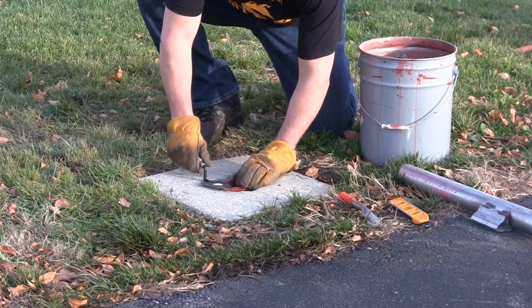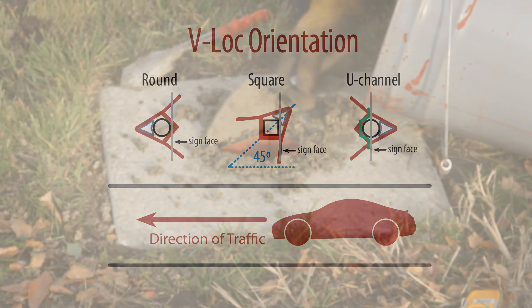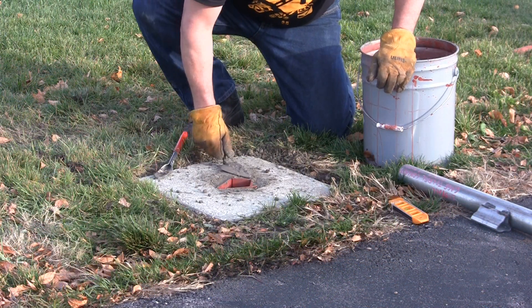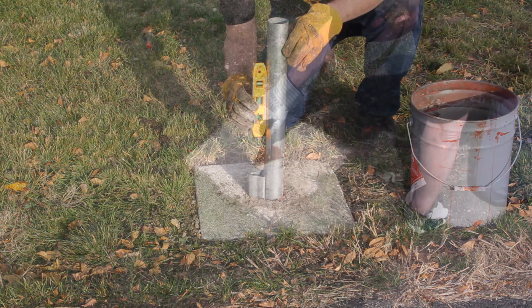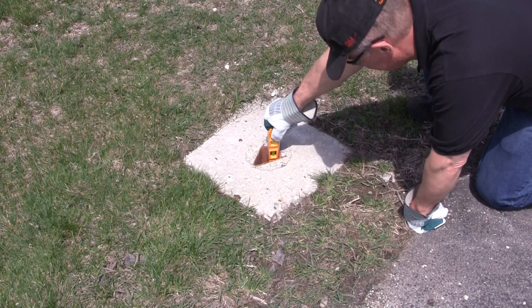Level with the concrete surface and oriented properly. Fill in the cavity between the socket and core walls with concrete. Trowel the filled concrete to level. Using the level, check for plumb in both directions on the stub or the inside faces of the thick leg angle, adjusting if necessary.